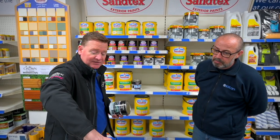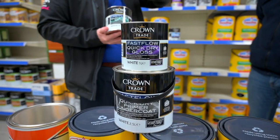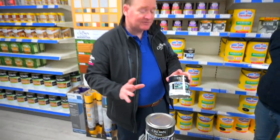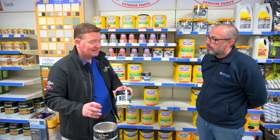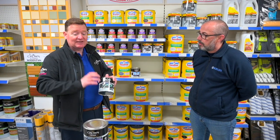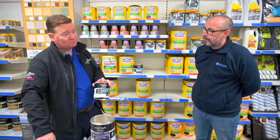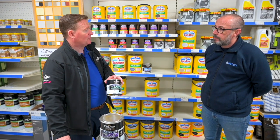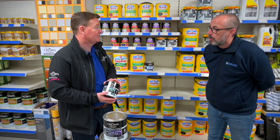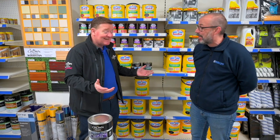Then you can finish with one of our Fast Flow finishes. You've got the Fast Flow gloss if you like that high gloss finish, or the Fast Flow satin if you want a duller, flatter finish. We can mix those to any colour you want. The beauty of that system is it's an alkyd acrylic — it's fast drying, it's low odour. So you could technically get all three coats done in one day. Whereas with the Power Coat — fabulous system — you're only going to get one coat on in a day because you can only re-coat after 16 hours.